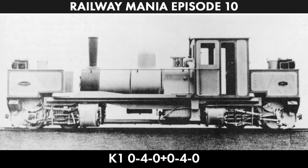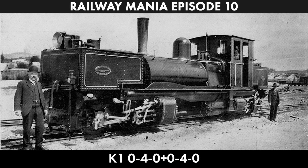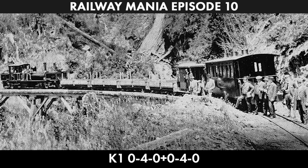The same steam was then fed into large low pressure cylinders at the front, using the steam twice and creating a softer exhaust blast up the chimney. K1 and K2 were indeed a success, though they had a tendency to lose traction on 50-ton trains as the local climate is exceedingly wet.